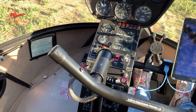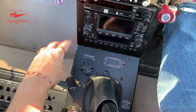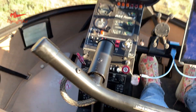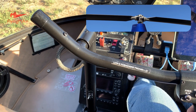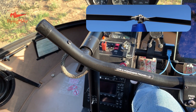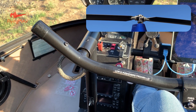The way this thing works — right now it's got the friction on. The friction knob is down here, and I'll loosen it up because I don't want to be forcing against the friction. Now when I move it, you will see the way it moves on the blades — it's going to change the pitch of the blades depending on their position in the rotation.